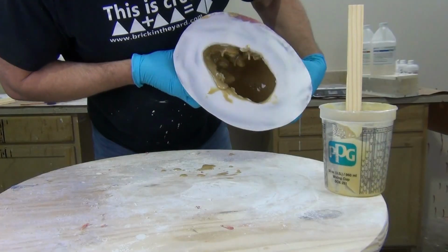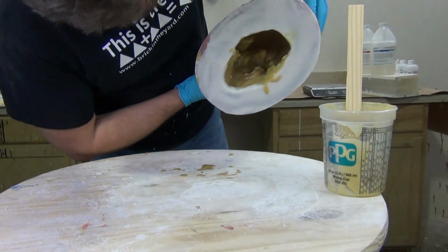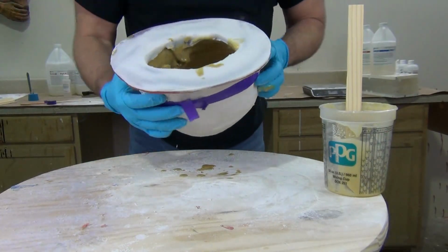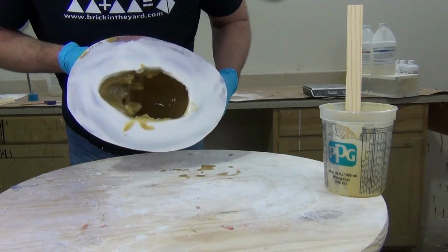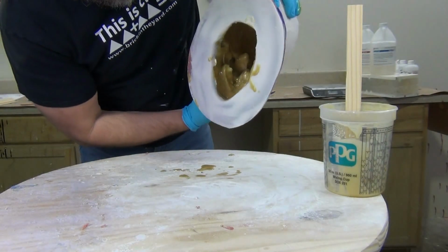And that's important for a part like a skull, especially the nose area of the skull. To capture that and get a bubble-free cast, that liquid state, sloshing it around, really gets us a nice clean face with no voids. So remember that. There are some foams we have that expand really fast, and this technique is not as practical.